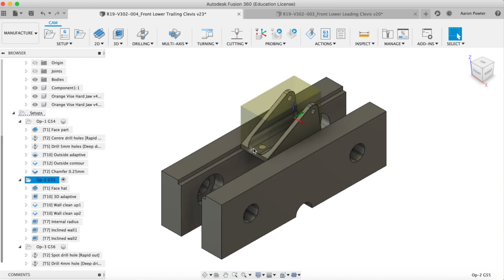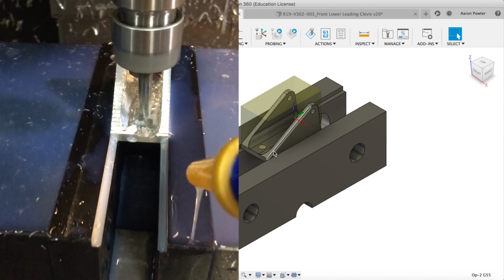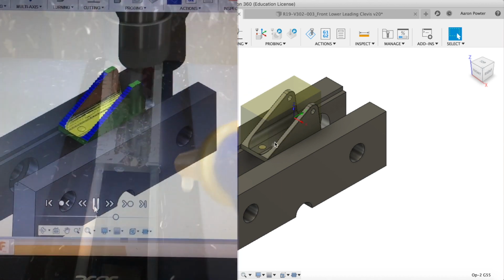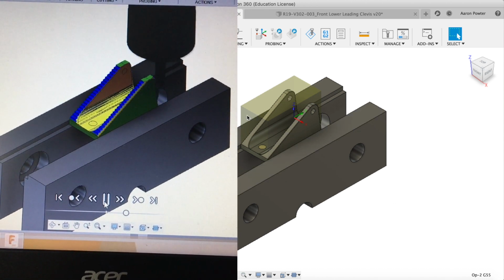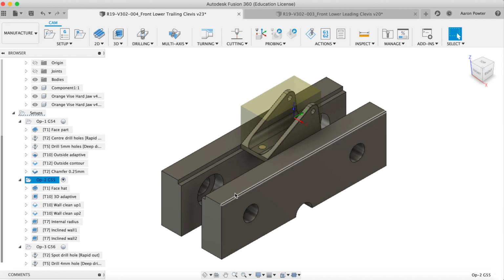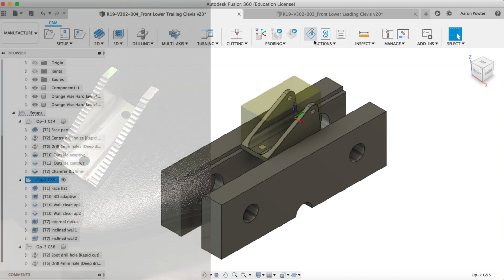and it was only when I did the 3D ball tracking in here that when it came over to do this angle here, I thought, oh, I think I'm going to hit the vise. I quickly ran over to the model, dropped these jaws in. These are exact representations of my orange vise jaws. And sure enough, the cutter would gouge into this. So I stopped it mid-cycle and swapped out these jaws for my aluminium ones. But look, let's have a look how I did this here.